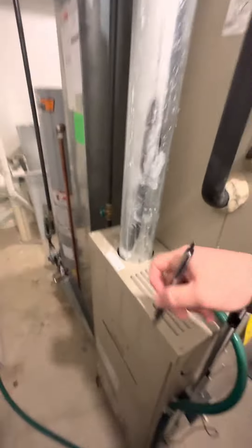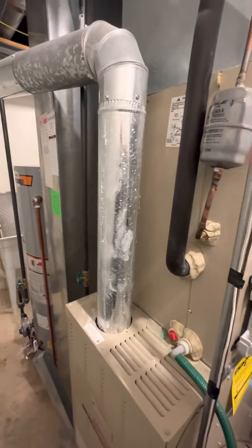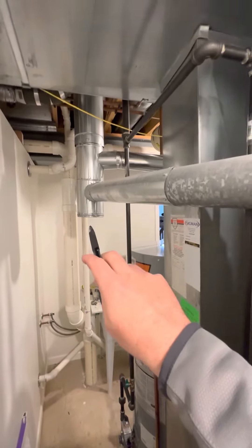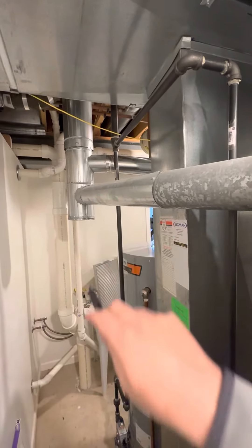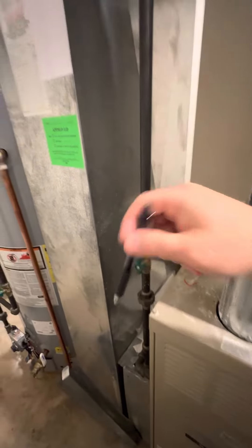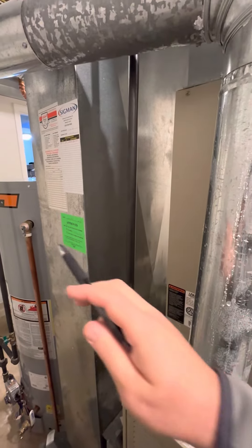The unit is a B-width Lennox, 40 inches tall, B-width coil, four-inch flue, six-inch clean out. T 6x4x4 on the water heater. There's a seven-inch gap. It's about 24 and a half, just shy of 25 by 10.